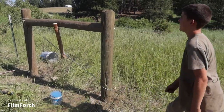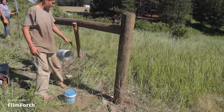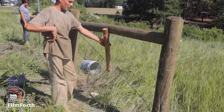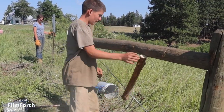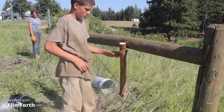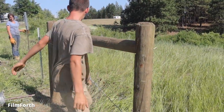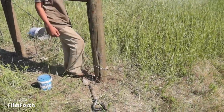Something you shouldn't do — I put the thing that twists up the wire on this side, but this is the side where I'm going to put my barbed wire. You're supposed to put it on the other side so it's not in the way. As for how tight to get your angle wire — I'm not sure of the exact measurement, but it's pretty tight. I can barely pull it back, so I might have tightened it a little too much, but it feels about right. Both posts are pretty solid, though there's a little gap that needs some more packing right there.